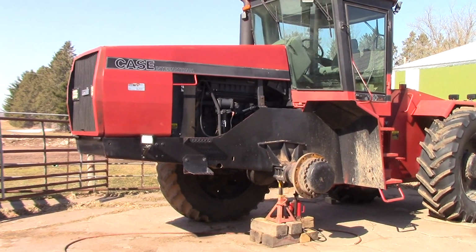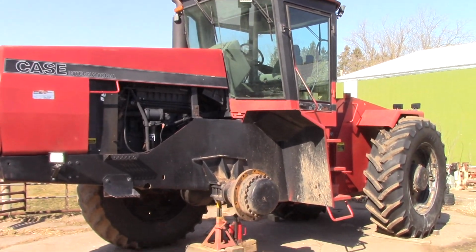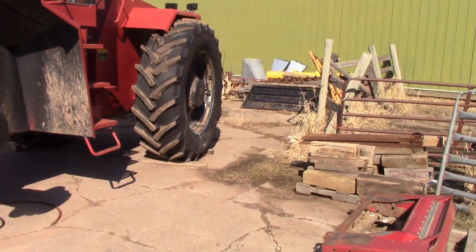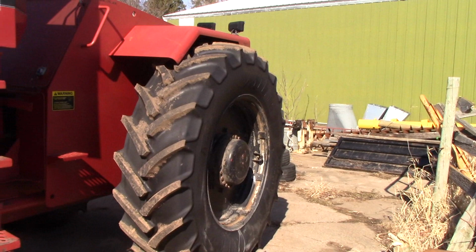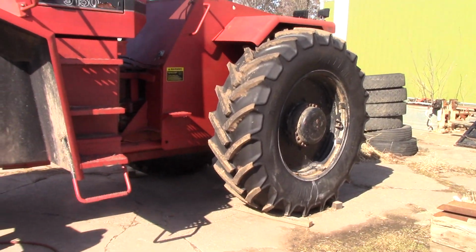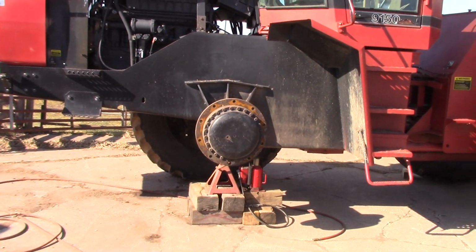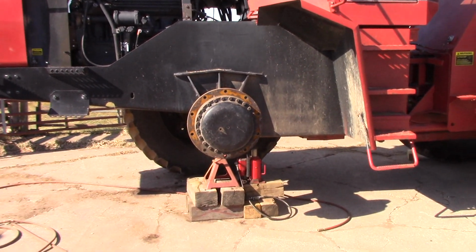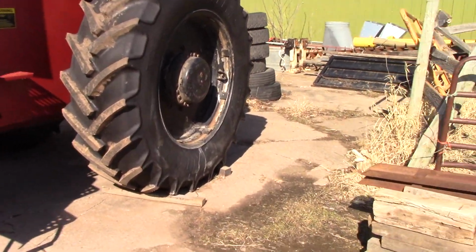And another thing we're working on is our 9150, the little tractor we acquired last year. You can see the front tires missing off it. It's because she's getting all new rubber. You see we've got new rubber here on the rear already. We're putting on a Mitas 520/85 42s, which is equivalent, like a 20.8 42. And this tire here is sitting on the trailer with new rubber on it. I'm going to put that tire on today. Then she gets her turn in the shop.